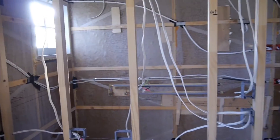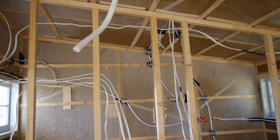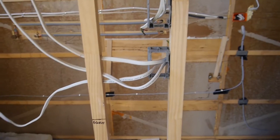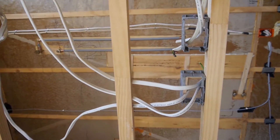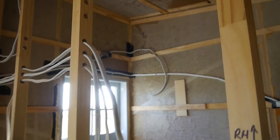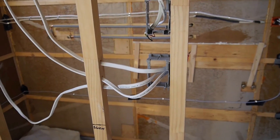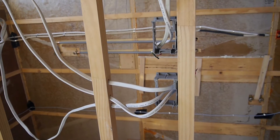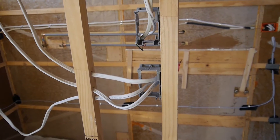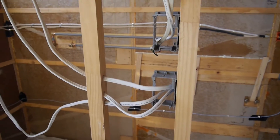The first thing to think about when planning your wiring is to keep your high voltage and low voltage separate if at all possible. This is a good example here - we've got a few wires connecting up, and this is a switch for a fan. We chose to run the fan on 240 volts because there's more selection and a fan doesn't use much power. We're only turning it on when we have a shower, so it won't run long - though you could run it on 12 or 24 volts as well.